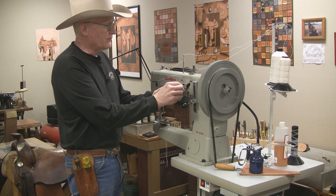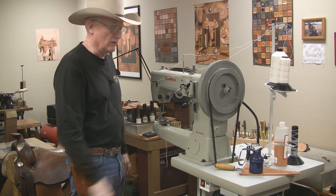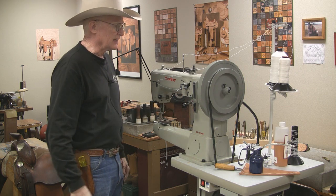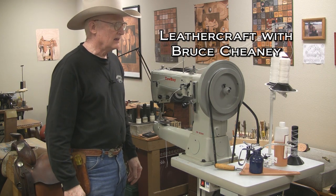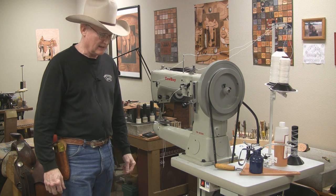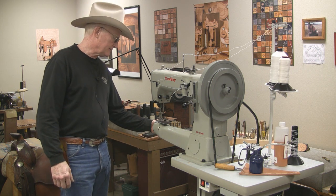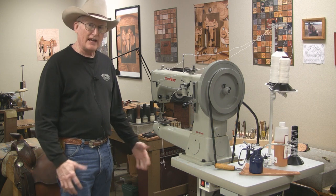I've got a fresh blank bobbin here that this machine will actually wind as I'm sewing. The lever here — that's the reverse position and that's the forward position. This little screw right here adjusts the stitch length, and that's the bobbin winder. I've got polyester 346 white on my machine and it sews real well with that. This particular machine has a servo motor on it, and it takes a little bit of adjusting to get the speed where you want it when you get a new machine like this. These bobbins are big enough that you can sew several pieces without having to change the bobbin.